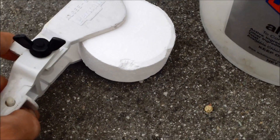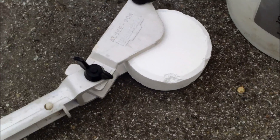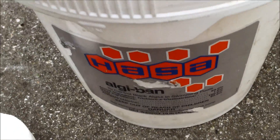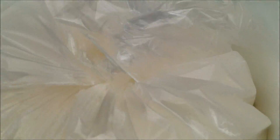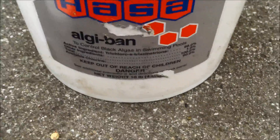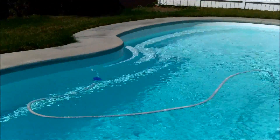If you do have black algae in your fiberglass pool — which can happen; in California black algae is really prevalent and I've had it in a fiberglass pool before — you can use the 3-inch tablet scraper and the Algae Gun by Pentair (I have a video on that device). You do not want to use granular trichlor for black algae because that will definitely stain your fiberglass. So shy away from any kind of granular trichlor for black algae treatment. I hope you find this helpful in caring for your fiberglass pool.